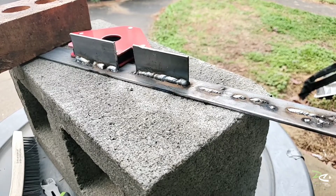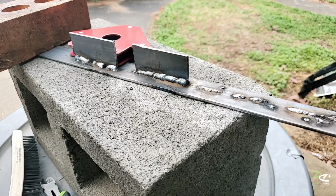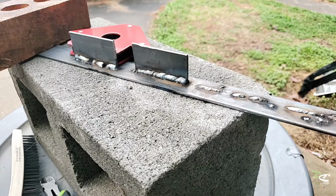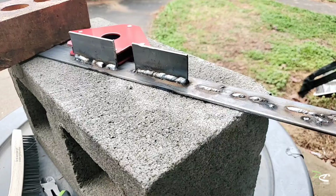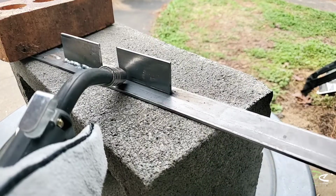I think the wheel was too tight, so every time I weld and it feeds, there's too much tension, put it that way. So I loosened it up a little bit and it seems a little better, sounds a little better. Okay, I'm going to do a full send at speed level 6.